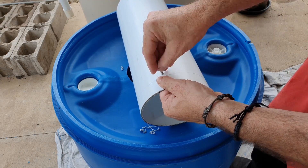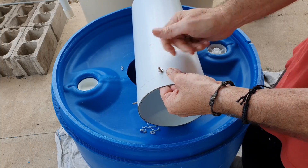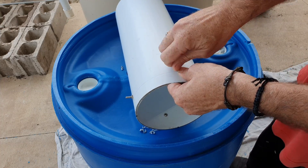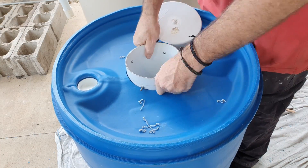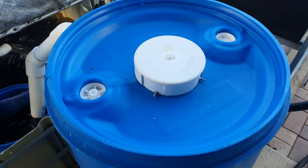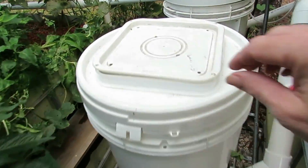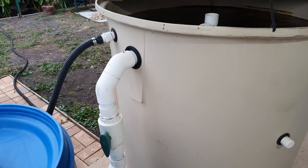To keep the well in place, I zap through the PVC and put a bolt on the outside. I've gone with 316 stainless steel marine grade bolts because the water in aquaponic systems tends to get acidic over time and even lesser grade stainless steel will corrode. These will last forever and I can recycle them across many different builds. That's pretty much it for the stilling well — a basic little build, and if you have a flatter top you can use something like a square bucket, which I've used in previous builds.